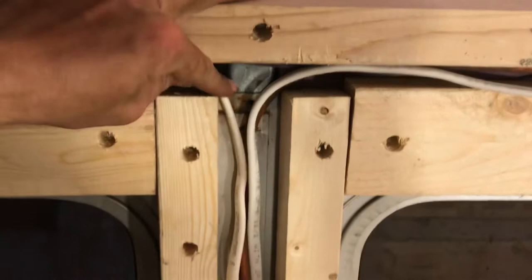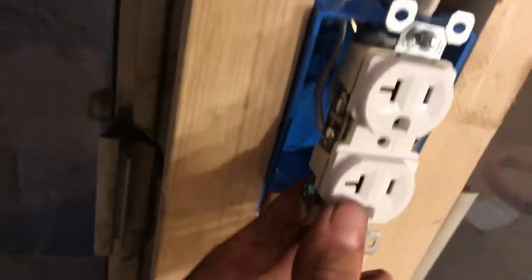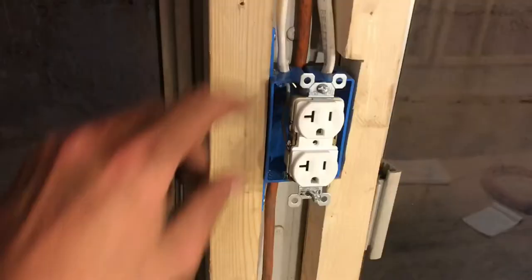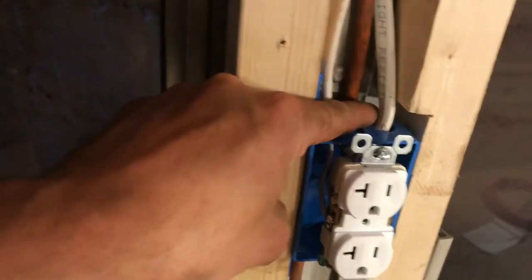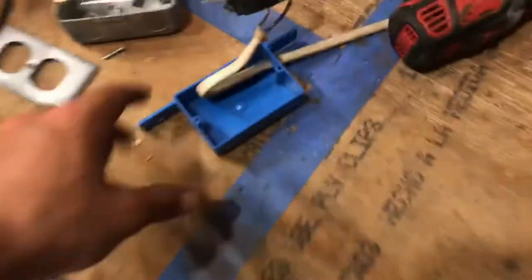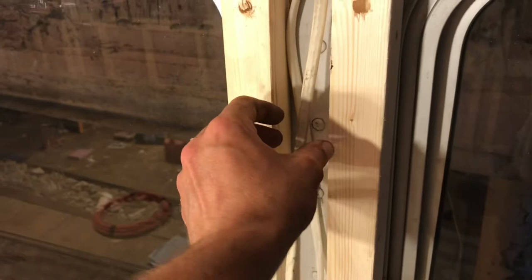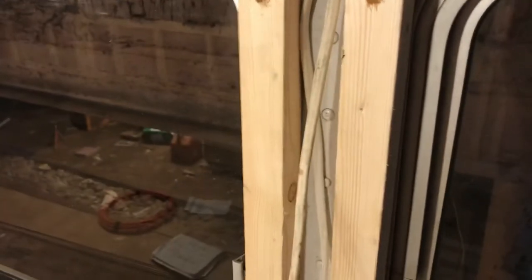Then when we're done, we pull it up and set the wires back in the channel. You don't have to worry about bunching wires up in that box at all, because these boxes are also really thin to begin with. We've got these thin profile electrical boxes so they fit perfectly in here — we didn't want to take up a bunch of space with the walls.